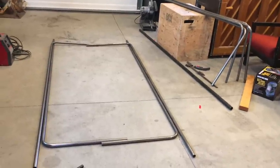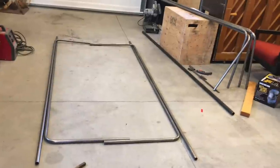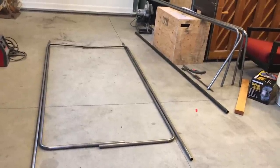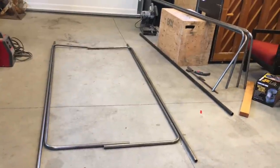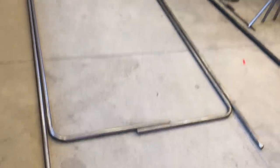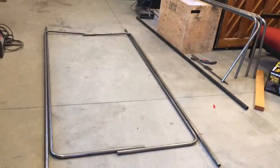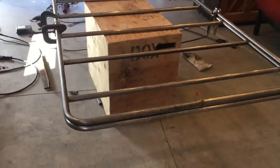This is a quick video on the roof rack I'm going to build for a fifth generation Toyota 4Runner - kind of a Gobi stealth style. I really like those but I don't want to buy one; they're quite expensive. You can really get the materials for less than a hundred bucks, plus paint or powder coat, probably looking at less than $200 total. The metal is 16-gauge steel tubing. Dimensions will be around 88 inches long and 45 inches wide.